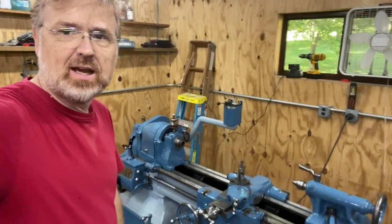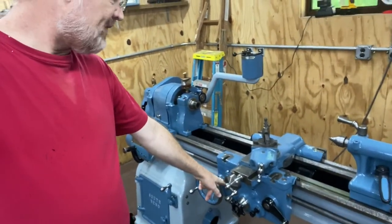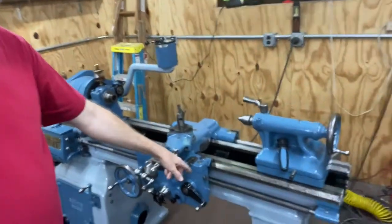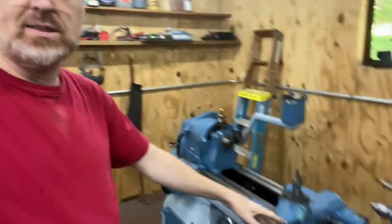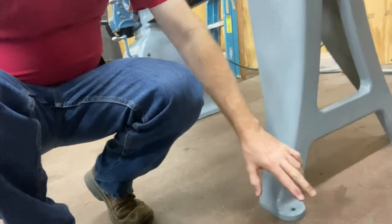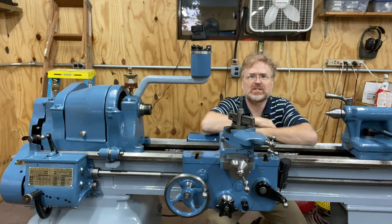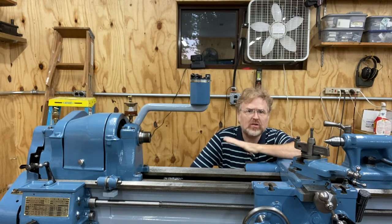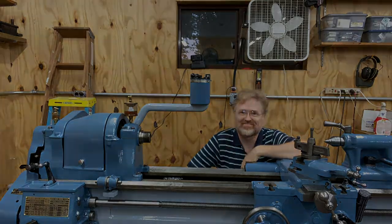Folks, I'm going to call this part finished. We are so close to making chips on this thing — I can taste it. A couple more things I still need to do: I need to do some research to find out what grade of oil goes in here and get that filled up. I need to clean up the three-jaw chuck and the four-jaw chuck — I'm probably going to make a separate video about that. I'm in the process of making a threading dial. I might make an extra video about that. Then I need to come back and do all the fit and finish and leveling — I need to get some feet in here and get this up on feet so I can then balance and take any twist out of the bed. All right everyone, thanks for watching — isn't she looking good? She's come a long way. If you enjoyed this video please give it a thumbs up, drop me a comment, and subscribe so you'll know when the next one comes out. Peace out.